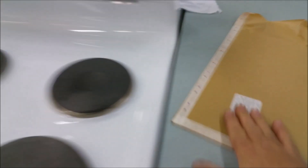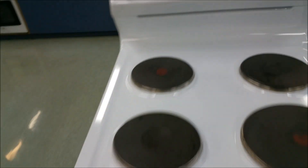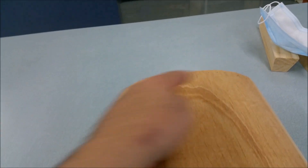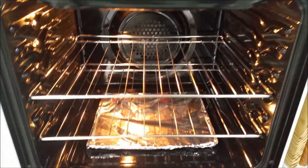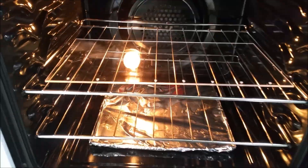In a home economics or food tech room some ovens are electric and some are gas — I want an electric one. We just need to check our piece of material fits. We'll turn it right up, preheat it, and take the paper off to make the plastic ready. I've wrapped some tape around the form instead of measuring it, to represent the depth. I've done all my drilling before heating the acrylic so we don't have to worry about that. We'll just let it warm up.